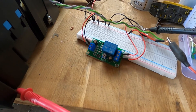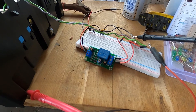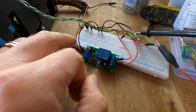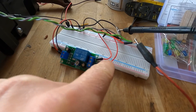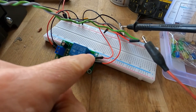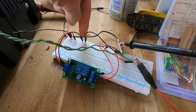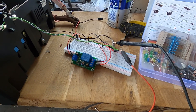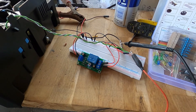I've got this little gizmo off the internet — just a delay timer. So what I've done is I've got DC coming in here. You then must have this middle one here connected to your DC in. I've done that via the breadboard. This then is going to be a power out — your positive out. And then your negative has to go back to common as well. I've probably not explained it very well — there are people out there on YouTube that are far better at explaining this stuff than me.